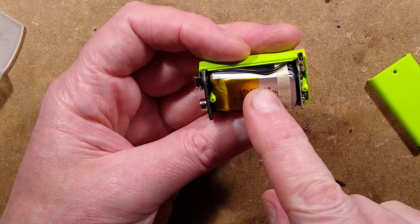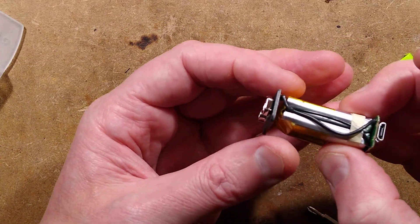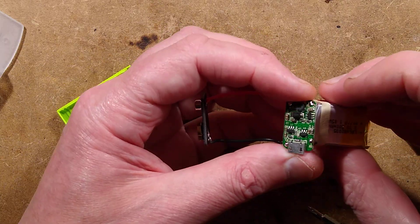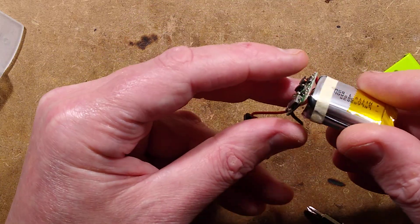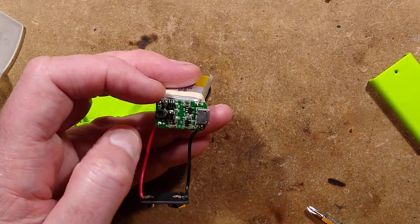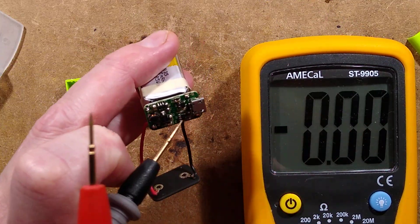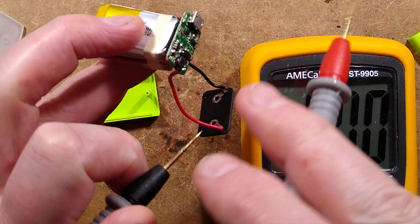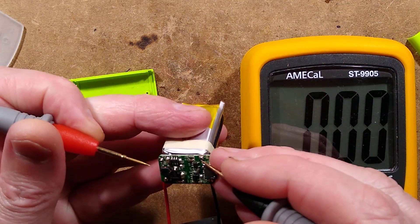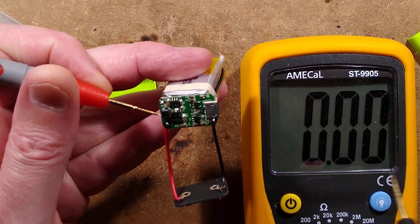Okay, a big fat lithium cell as we'd expect. Or is it a stack of two? It's a stack of two. But are they using them in series or parallel? The cap and end just hinges down like this to the circuit board at the bottom. I think it's time for a close up of the circuitry, and I'll also test this. Let me bring the meter in and see if it's using two cells in series or parallel. I'm guessing they wanted to squeeze in as much as possible, so it might be two in parallel just to get the size and thickness. The voltage is 3.78 volts, so that suggests this is just two cells in parallel.